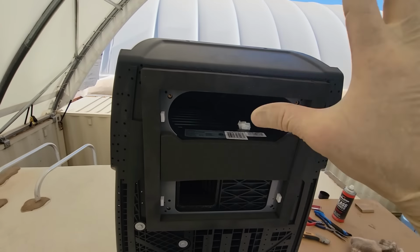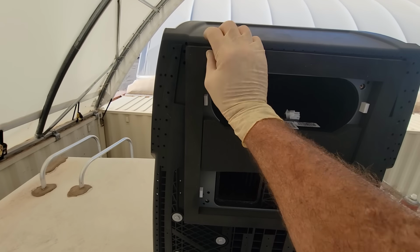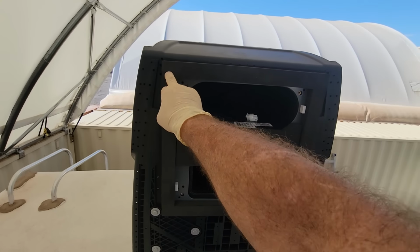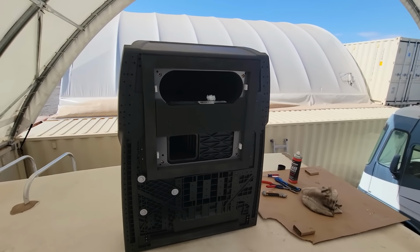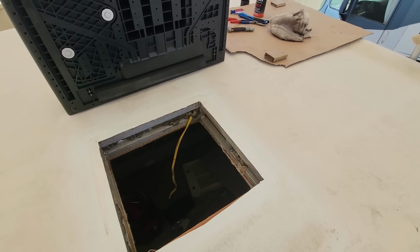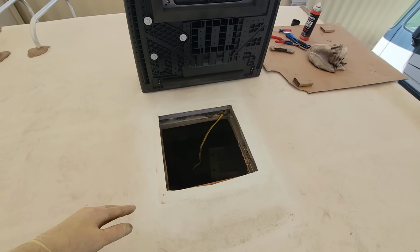Whenever you see me on a roof doing a roof inspection, and I kind of just lean against the AC to see if it's loose, I'm making sure that the bolts that clamp this down to compress this seal aren't loose. So that's the only thing that's actually sealing the AC to the roof. But all I'm going to try to do is line this up as best I can in the opening down here. If you have somebody down there, it'll help. Otherwise, I'm just getting in the general vicinity, then I'll line it up on the inside.